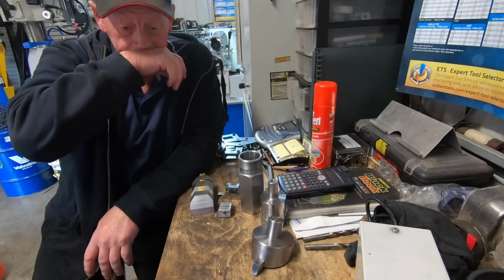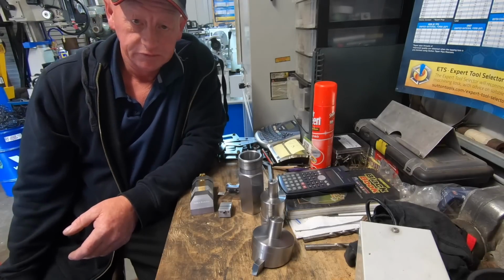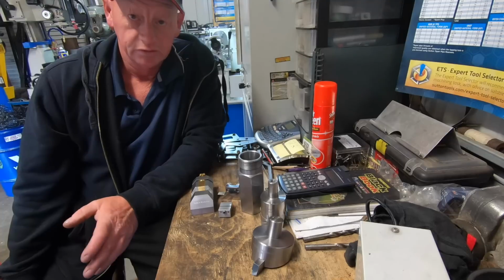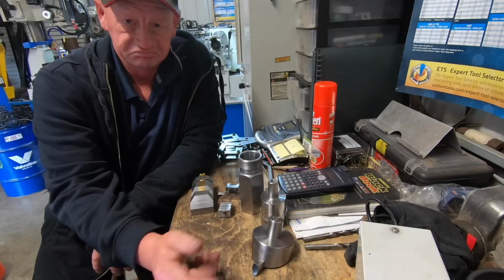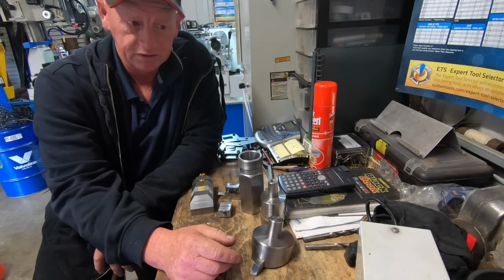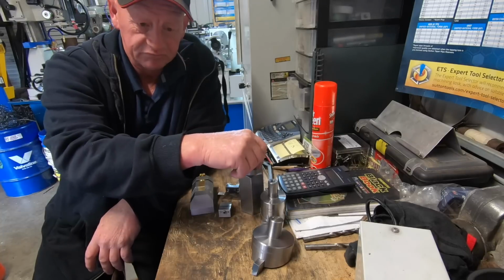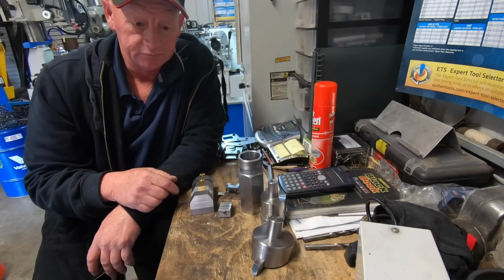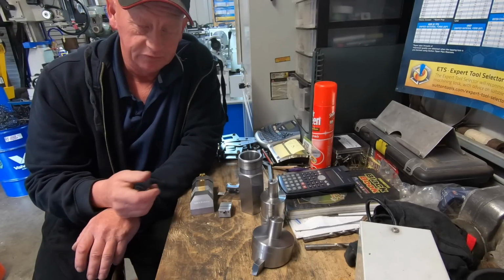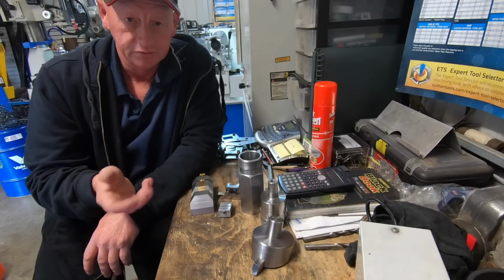Phone wall charger, you know, an old charger for your mobile phone, you can use that, it'll work. I have tried this up to 14 volts, still works, doesn't make it any quicker, it still etches in, but I normally run it at around 7 to 8 volts, full current. It'll pull around 0.5, 0.6 of an amp sometimes, and just fluctuates. Really what you're doing is shorting it out.